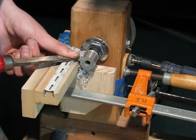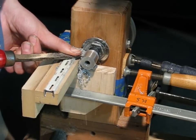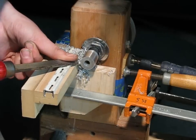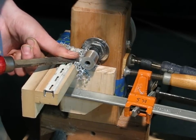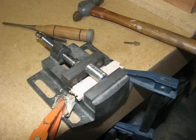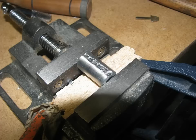That's what I did for the second adapter which holds the pulley to the other end of the spindle. The adapter to put the pulley on the other end of the spindle looks a lot like the chuck adapter, except you need to cut it to keyway. If you had one, you could use a milling machine or a metal shaper, but I just cut it with a wood chisel. Pot metal really isn't that much harder than some hardwoods.